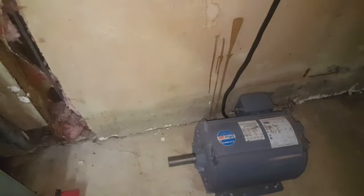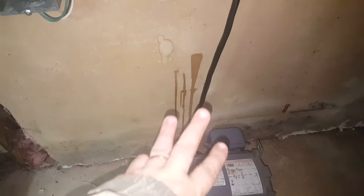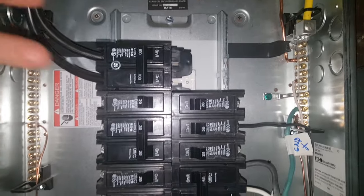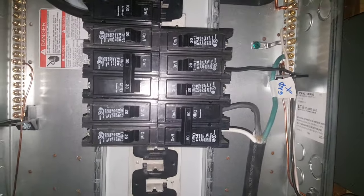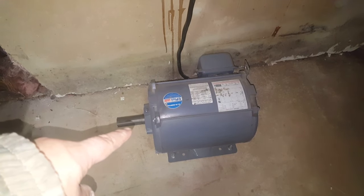What this does is take 220 volts and run it out as three phases. The way your breaker panel works is there's 120 and 120 volts coming in from each line. From one breaker you get 120 volts; from two breakers — those double ones — you get 220 or 240 volts. We're going to send 240 volts to that motor, and once it's running it will generate a third leg, a third phase, because we need three phases.